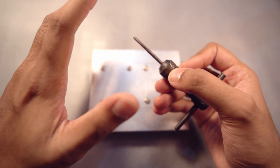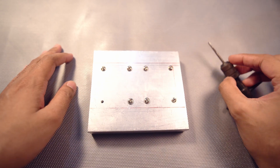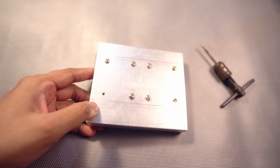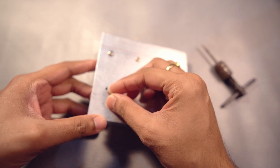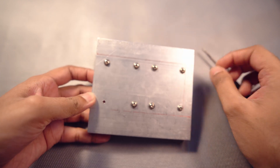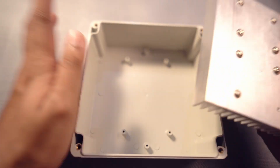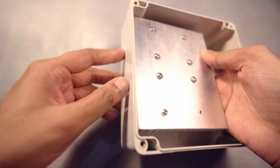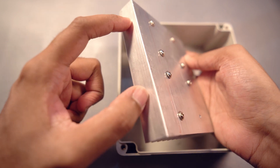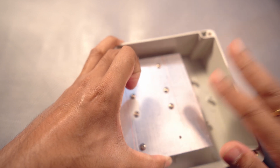Threading is the most time-consuming and frustrating thing in this process, and I did mess up one of the holes while tapping the thread. But that's not the end of the world — I'm going to use a 2.5mm screw here and bolt it down to the resistor, since it's just about securing things to the heatsink and it doesn't matter how we do it. All the other holes are fine and it's done. The next step is hooking this heatsink onto the box, making M4 holes and tapping two places, then using a clamp for extra support.